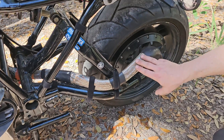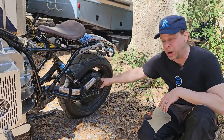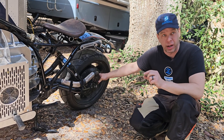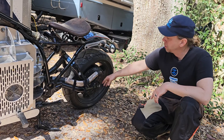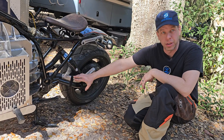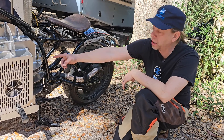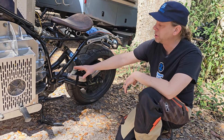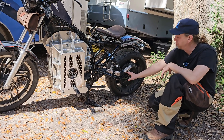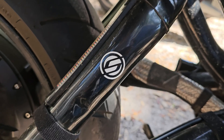The hub motor comes with its own wires. Looking at the base you can see we've got a three-phase motor but six wires — in order to get enough energy into the motor we had to split the phases into two conductors. I hand-formed all of this and then spliced each phase from two conductors down to one, so we've got one-gauge copper from there the rest of the way to the motor controller. All hand-spliced, handmade conductors back to the hub drive.